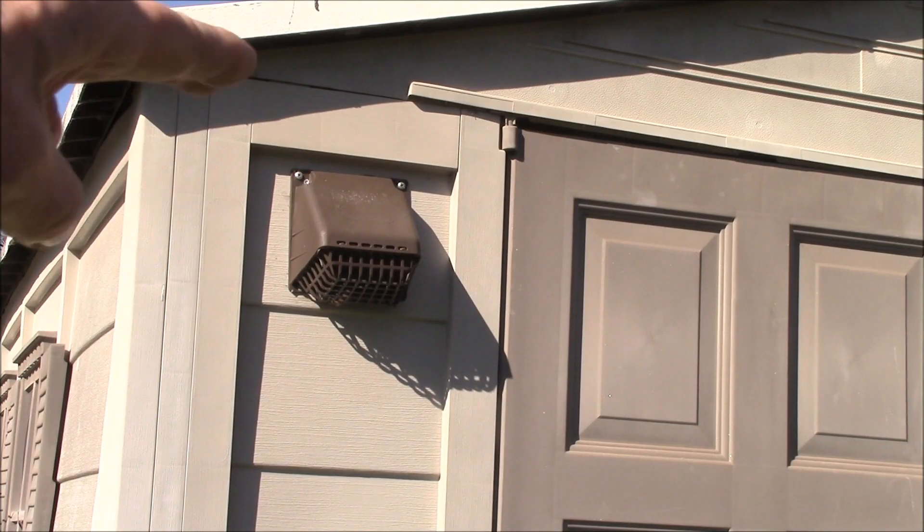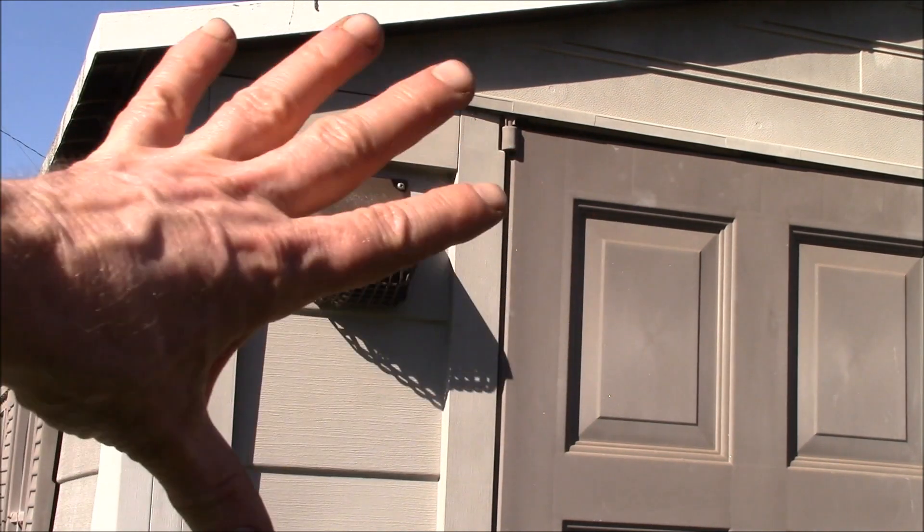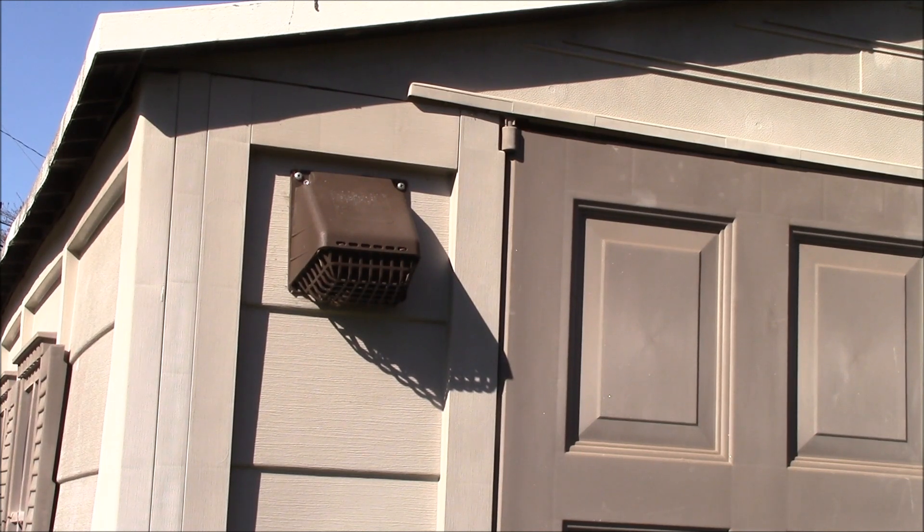The shed's been working really well. I have one fan on each side, and they're running today since it's sunny and warm enough to trip them on. In the winter, the fans help clear out moisture and humidity that builds up — overnight it gets cold and foggy, a little damp inside. Once it warms up, the fans kick on, suck warm dry air in, and keep everything from rusting. The original 12-volt PC fans are still working fine.